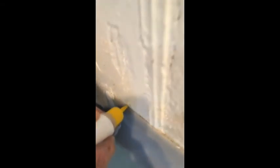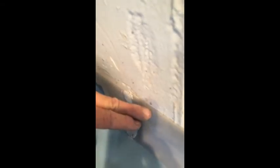Materials as they cure, some of it tends to want to bow away from the wall. So for example, right here where we get a little gap, let's just say, I can come in with this and I can actually put some of this adhesive here and just press it in against the wall, hold it for a minute, just so it grabs. Instead of using screws or nails, we're trying to keep everything really easy here. So again, if I see little spots, I just tack them up, okay?